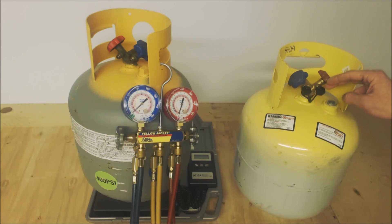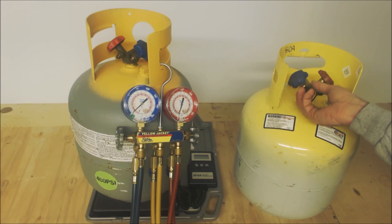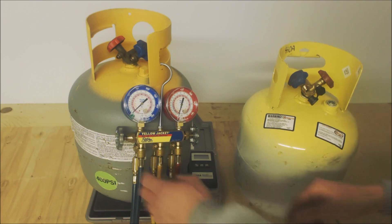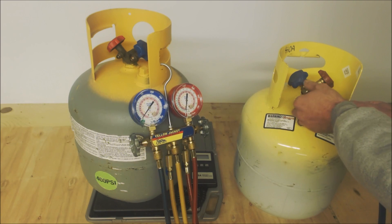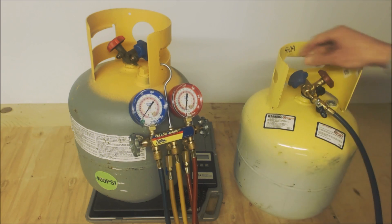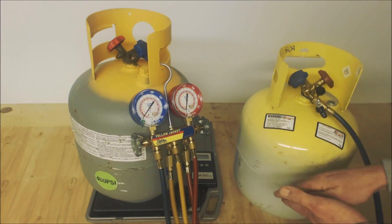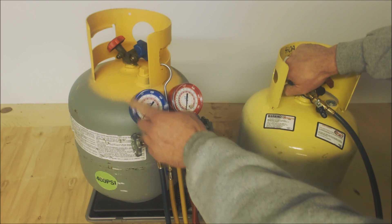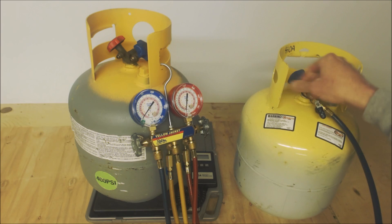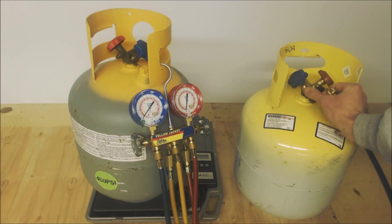We're going to suck this down to a 500 micron level, but first we need to see if the manufacturer has nitrogen pressure in this bottle or has already pulled it into a vacuum. We need to check that out first. I'll make sure the handle is shut, then open it up just a little bit — in case it's full of pressure — to see if it reads negative inches Hg or has positive pressure. This tank actually has very little in it, just a slight negative pressure.